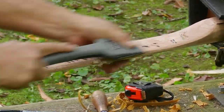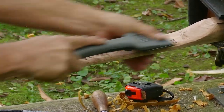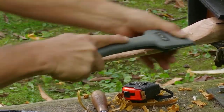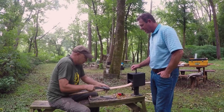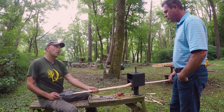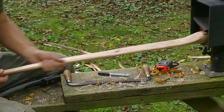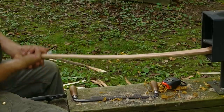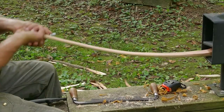I'll go in there with this paint scraper. I'm to the point where the draw knife might be just a little too aggressive, so it's the stage in between a draw knife and sandpaper — that's a paint scraper. I'll feel it for any scratches or sharp corners. You want to round those off, because when you go to bending it, that's where it'll break and splinter. I'm pretty happy with that. Flip it around — those limbs may be more even now.